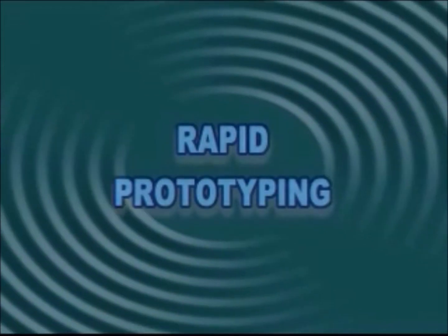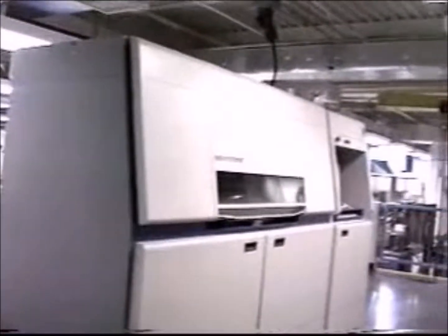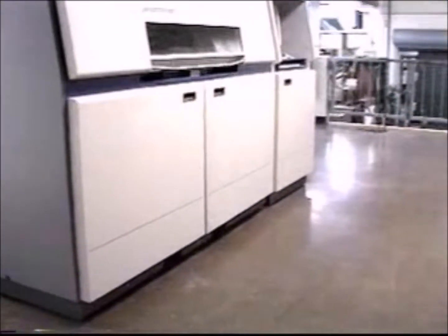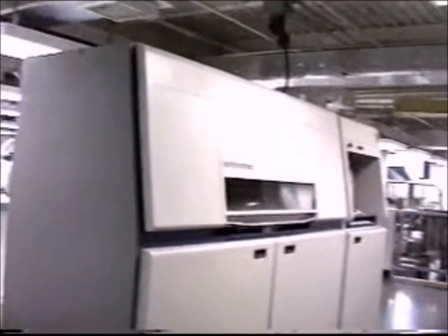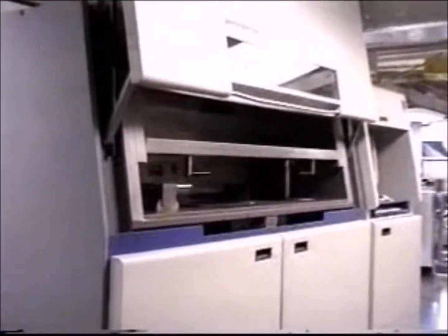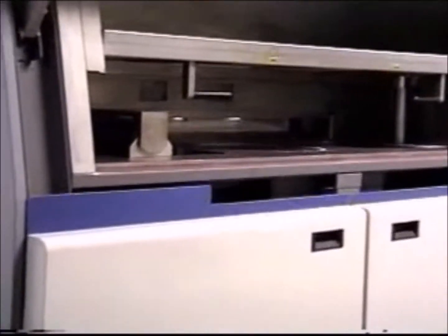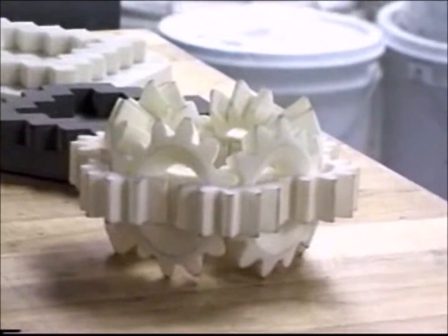Creating physical models using rapid prototyping. Metal powders are used to produce green bodies by selective laser sintering and subsequently sinter densified in a furnace. This involves melting an admixed polymer with a laser to bond the metal powder together. The laser scanning pattern is determined by the computer-aided design data. The object is built by incremental layers of powder and bonding the appropriate areas with the laser. Here you can see some processed parts.